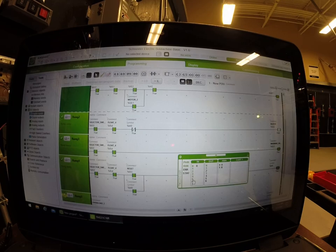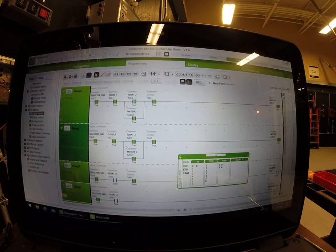The warning light is there because there's still too much water. The only way the water will go away is if float switch number four gets back to a level that's acceptable. We're going to pretend that happened by hitting input four again, and then you'll see the warning light went away — but we still have two pump motors running because we're not below that threshold yet.